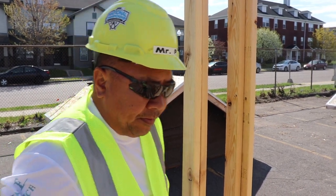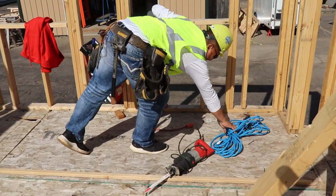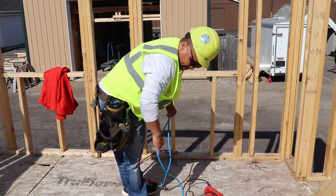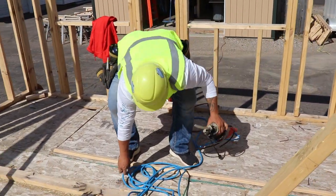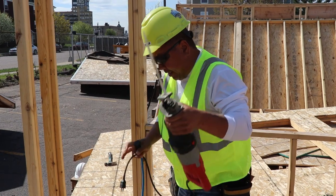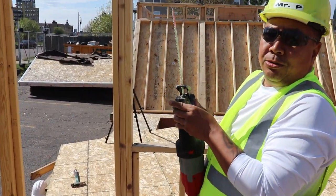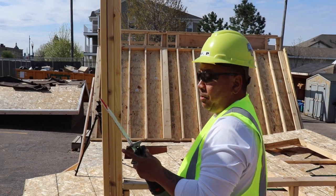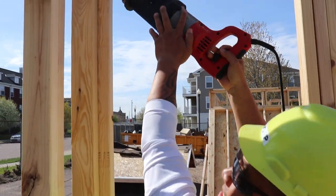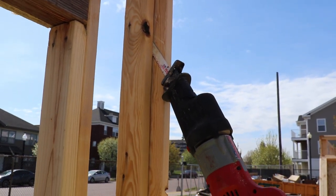The other way of doing it is taking a sawzall. I've got a sawzall right here with a cord. This is a construction blade — a construction blade can cut through anything: nails, wood. They're metal blades, but why waste money on a metal blade when you can get a construction blade? What you want to do is stick it in there like this and press the button — it doesn't take much, it already cut through that nail.